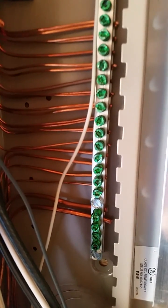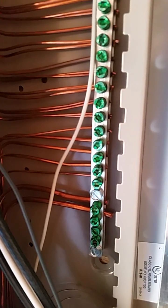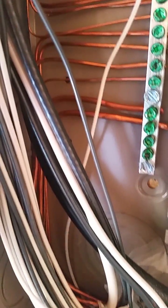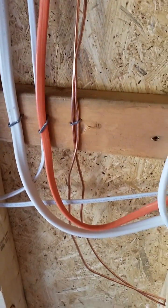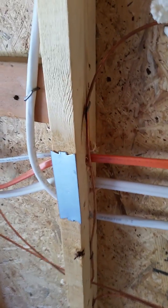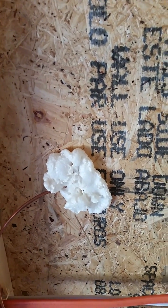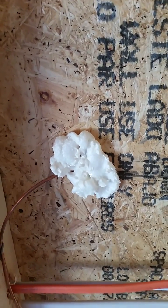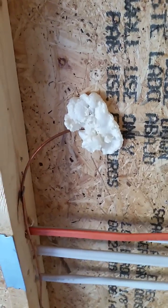We're looking at the number six ground wires — those are the two thick wires at the bottom. They exit the panel, and stepping back, you can see them right there. This is how we're going to ground that panel. They head over to a grounding bar. The first one goes up and heads outside — we'll see it in another video — where it will be attached to a grounding block for exterior electrical equipment.